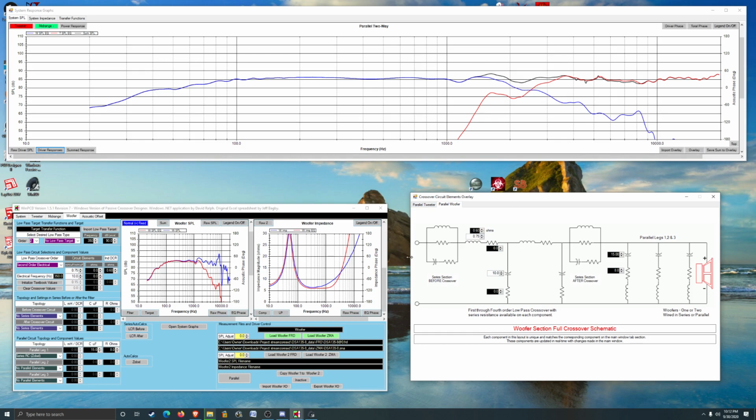But yeah, it'd just be a matter of getting that amp and measuring how deep it actually sticks in, because you don't want the back of the woofer hitting the plate amp. So it's just a matter of doing that and building your enclosure around that size. So I think we have a really good start on what we want to do, and I'll probably fine tune a little bit more of this.